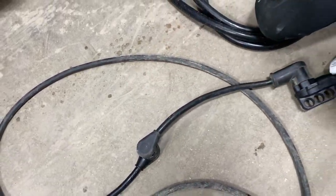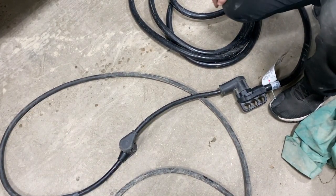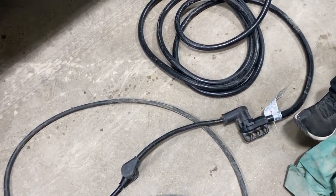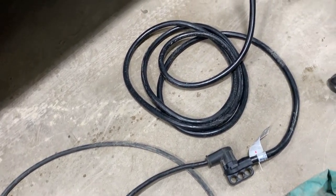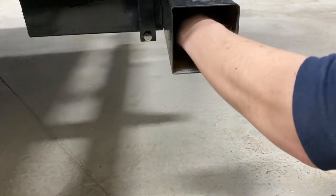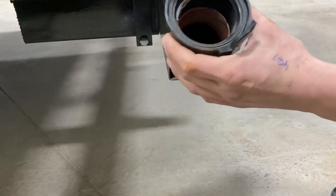Right in the very back here you've got this little black port. If you open that up, you can see you've got the little metal tab in the bottom edge there. That'll line up with this metal tab here on your short cord. Press it in, a little eighth turn locks it into place. Screw on the threads in the back and that really locks it there.